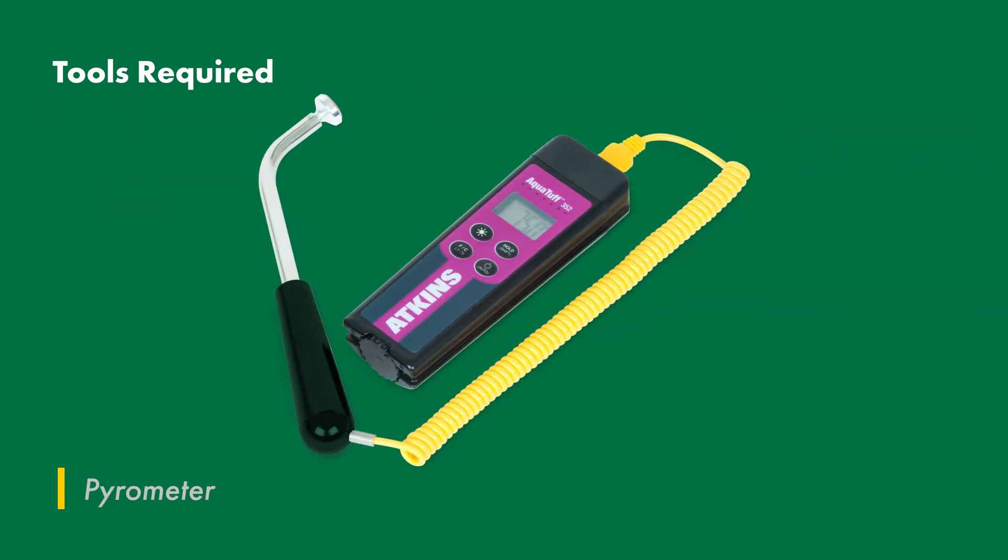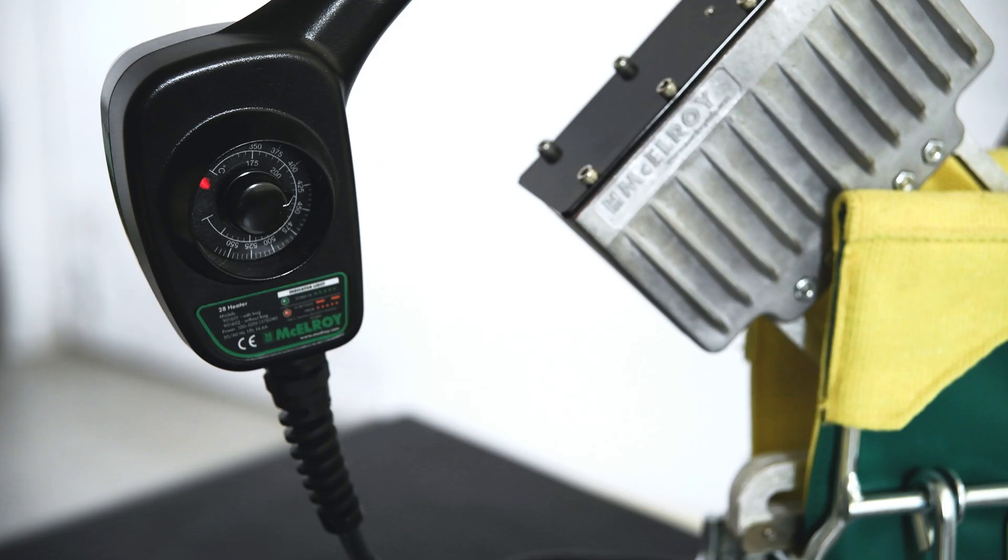The latest generation heaters have improved LED error lights to help with your diagnosis. If you look near the temperature dial on the heater handle, you'll see a series of quick flashes followed by a pause. The number of flashes will help determine the type of problem your heater is having and where to start your diagnosis. While these lights may be a helpful starting place, today I'm going to walk you through the process of checking all the electrical components to help you evaluate your heater.